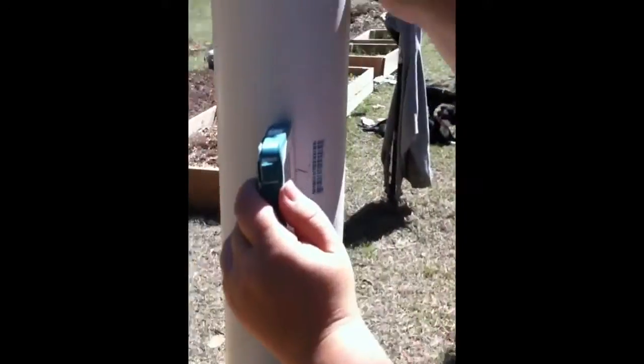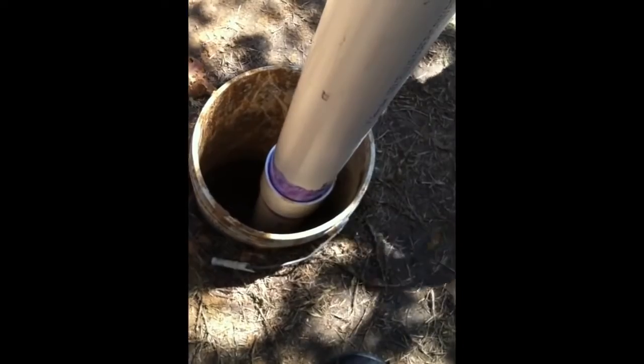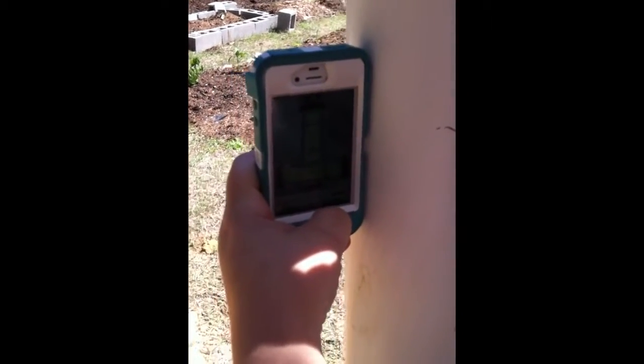The shaft is now filled with the casing. I didn't get this on film because it took all hands to keep it straight so the couplings didn't break apart when lifting it. You can see the 20-foot mark where the coupling is — we're a little over about 20 feet. Once it's finally in, give it a good push. Now you have to level it and backfill with pea gravel — all these bags here — up to the water line. Measure the water line first before you start. If you don't have a level, there is a cell phone app — you can put your iPhone against it and the app acts as a level.